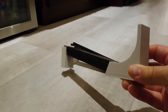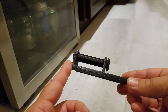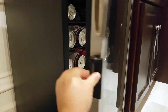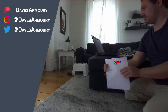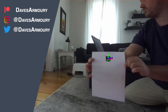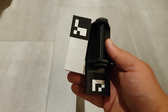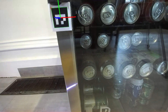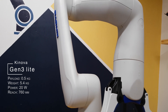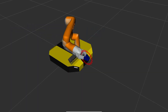I'm using 2020 extrusion and some 3D printed legs to make a little ramp holder for the beer, so the cans always roll forward and the arm can keep picking up from the same spot. I could use AI to find beer cans, but that's a lot more work and a lot less consistent. For localization, we're using ArUco markers — kind of like QR codes — so a camera can figure out where they are in front of it. As long as the robot gets close enough, the cameras can localize where the beer and the fridge are without needing super accurate navigation. The Gen 3 Light arm from Kinova uses the exact same driver as the Gen 3 arm from the weed killer video — a six-axis collaborative arm with a built-in gripper.